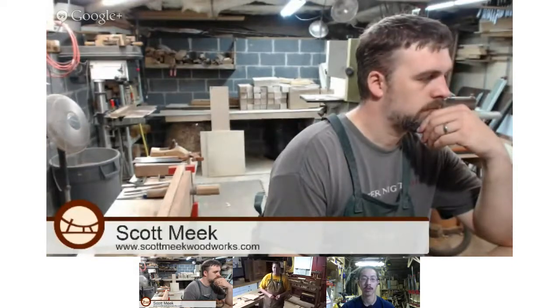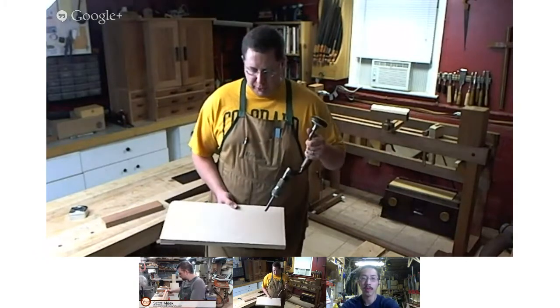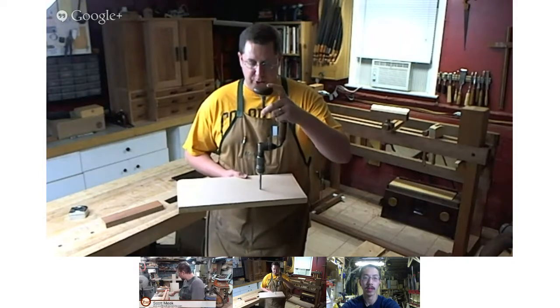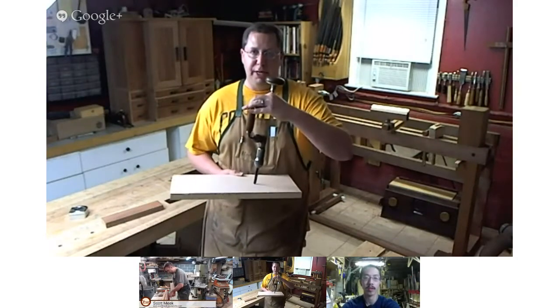Of course. Now, one thing I've wondered, Shannon, and you're the perfect guy to ask as a left-hander, can you use a spoon bit the other direction and still drill? Absolutely. You can. In fact, the way to start it, it's just like sharpening, everybody's going to tell you 20 different ways to do it, but the way I was always taught is you set the bit on the wood and you turn one direction first about 180 degrees, and then you go the other direction 180 degrees.